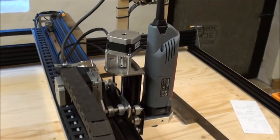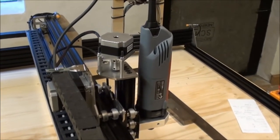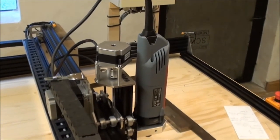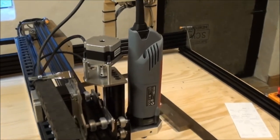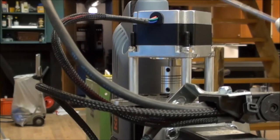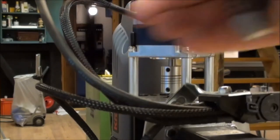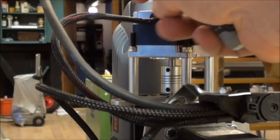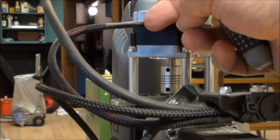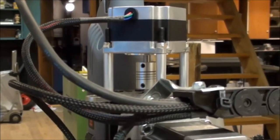So in this short clip, I want to show how I have done the wiring of the router here. Right here you see the C gantry, and if you go a little closer, I have the wires coming out of the stepper and then through this flexible hose here, and they tend to unravel, so I have put on some heat shrink tubing here and at the other end, and then right in here at the beginning of the cable chain